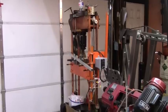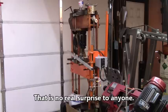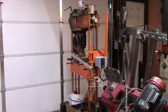I was looking at the plastic injector the other day and realized that I had put the handle on it wrong. The little hingey parts were in the wrong spot, and probably that back piece was too tall. So I'm gonna take it down and put more adjustment holes in the back of it, so I can bolt it on lower and higher and whatever, and get the exact right leverage out of the handle.